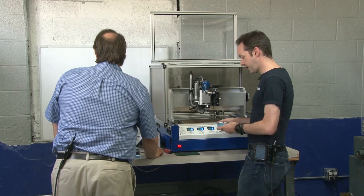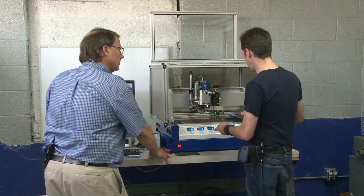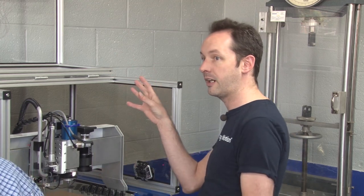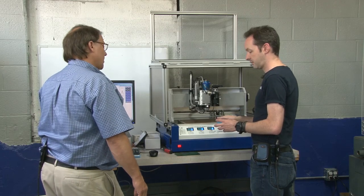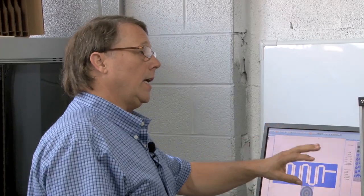Can you have — like if you say these are the tools I have and you've got a dozen tools and 20 spots on the machine — can you just put all the tools you have in there? And then it says, here's your Gerber file, these are the tools I know I have, I'm just going to make do with what I got. It will do that. What it's going to do is look in your tool rack and see what tools you already have, compute the offsets, and then the ones that it needs that you don't already have, it will ask you for.